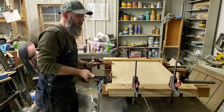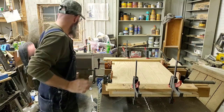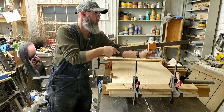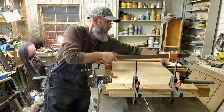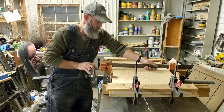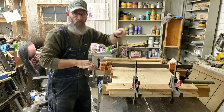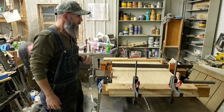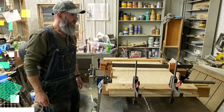Finish clamping these up. Try to put even pressure on it. Okay. And I'm just going to take another clamp and put across the top here. I'm going to get me a damp rag. I don't have it ready right now, but we'll do that off camera. But just to let you know, I'm going to get just a damp rag and wipe off as much of the excess glue as I can. And then we'll let this dry. And we'll see you in the next scene.